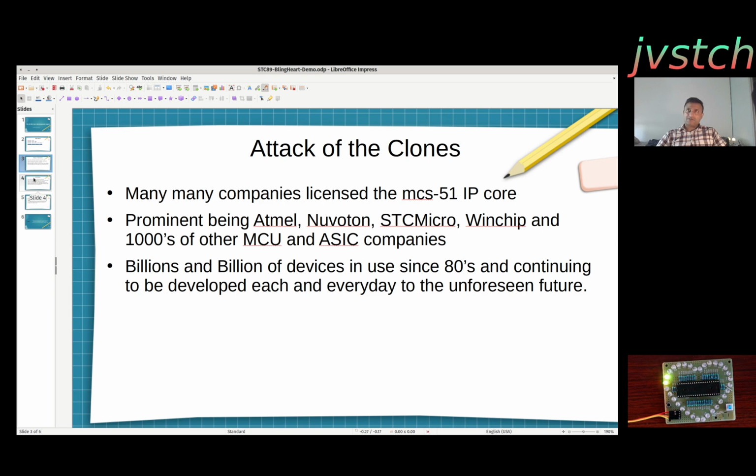So the only difference between Arduino and this 8051 and some STM8 and PIC is that the C compiler is pretty capable, the open source C compiler as well as proprietary C compiler, but there is not a lot of traction for a C++ compiler for this particular 8-bit microcontroller, unlike the AVR series. So the AVR series got a pretty good C++ compiler which triggered development of a lot of libraries using the C++ paradigm, like class and inheritance and all those things.